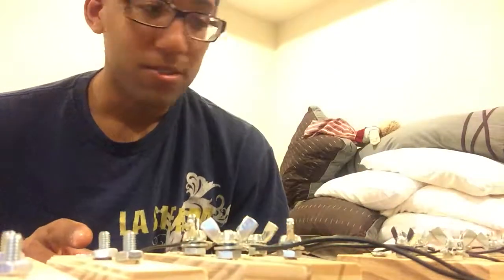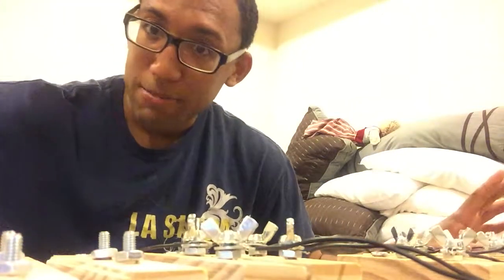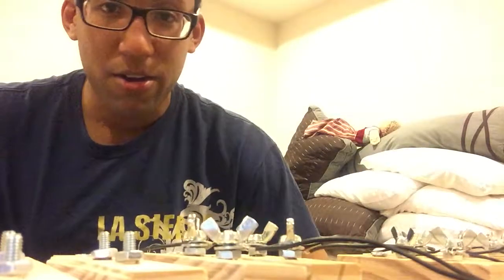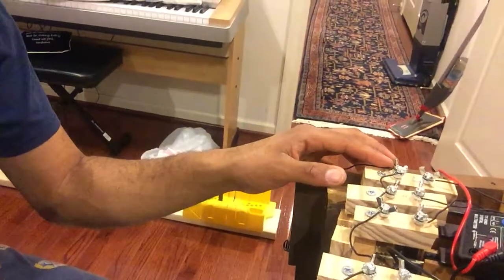Once you've finished wiring, you're going to need power. At either end of the power segment — the bottom row of your pedal board — you'll need two more wires. One is the power wire, which I already showed you how to do. The other is called the ground wire, which is very important. The ground wire connects at the other end of the pedal board — current comes through the bottom, and you'll need a ground wire on that side just like you did on the power side.